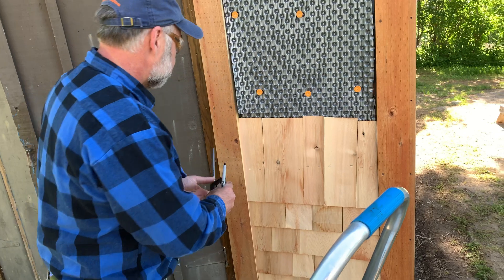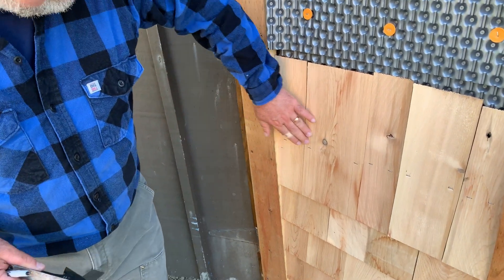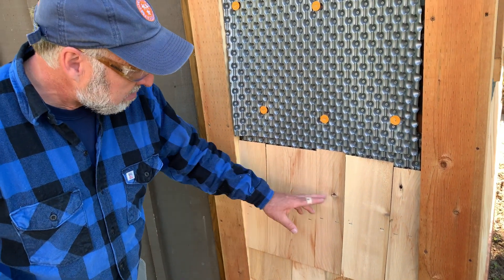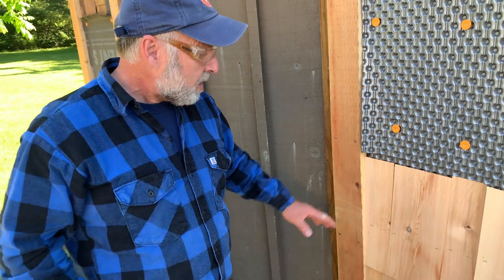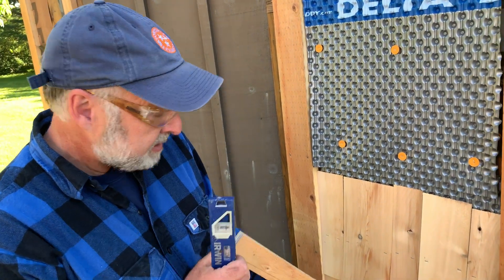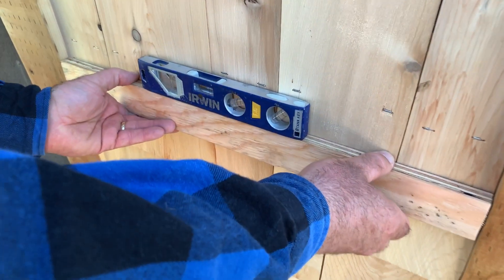Combination square set to five inches — I'm just going to make a slight mark here. It's important that the staples be up above the overlap zone by an inch to an inch and a half or so. You don't want them too far up above though, or you'll have curling shingle syndrome. You want them as low as possible while remaining clear of leaking issues. So leveling the shingles here — leveling this support strip — is easy with just a regular level over such a small distance.